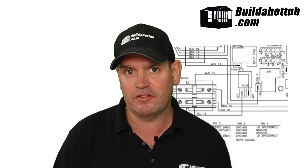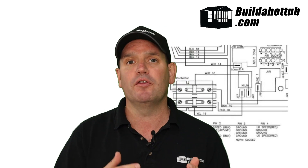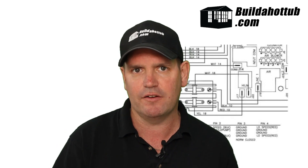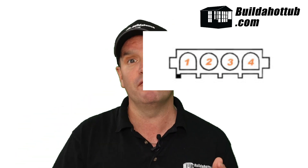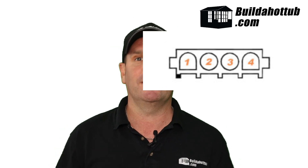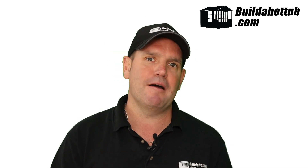A pinout diagram will look something like this. The key to reading a pinout diagram is looking which way the legs are pointing, because quite a lot of manufacturers will actually turn these connectors around. So you're looking for the legs to be pointing in the right direction. You're looking for the flat elements on two out of the four connectors. As you can see behind me, the dome shaped with a flat on — that will tell you which way it's actually going into the Spa Pack, because the Spa Pack manufacturers flip them over all the time. Looking at a picture, you could end up with your connector in the wrong way round, putting live onto a ground, tripping your breaker, and wondering what's going on. So look at those pinouts — you're looking for a high speed live, a low speed live, a common, and a ground. Don't rely at all on the colours.